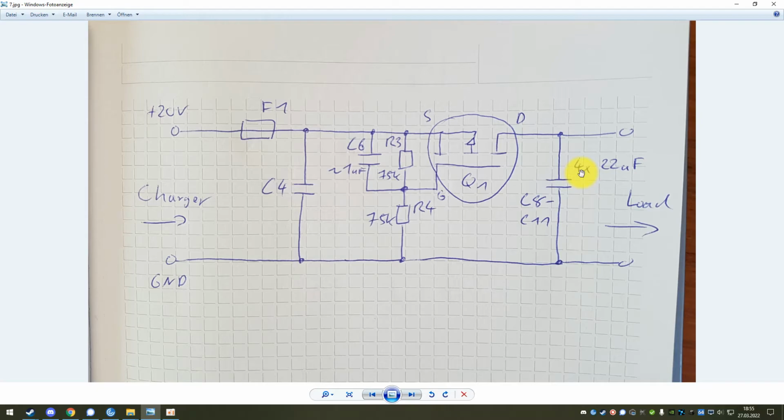So a way to find a shorted capacitor is you can inject power. You can solder wires to here and here, and from a power supply you can inject voltage and current into the circuit. Of course, limit the voltage to 20 volts and set the current to whatever you want, because this capacitor is now a dead short. It will conduct as much current as you want. So in my case I went with 10 amps in the end, and that only took like 2 volts to drive that current.